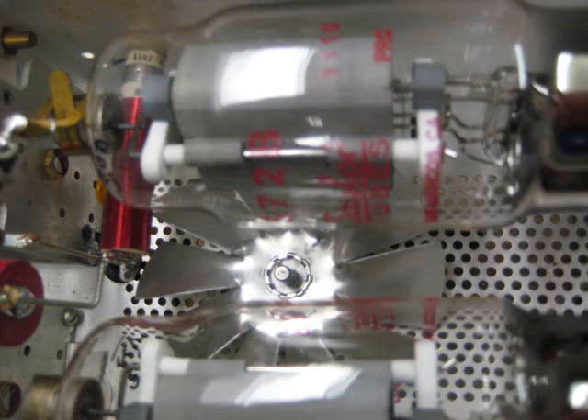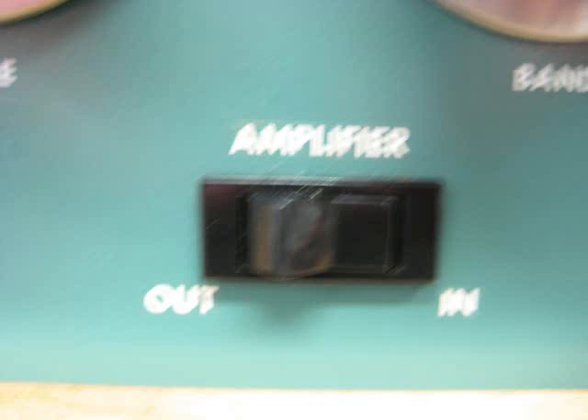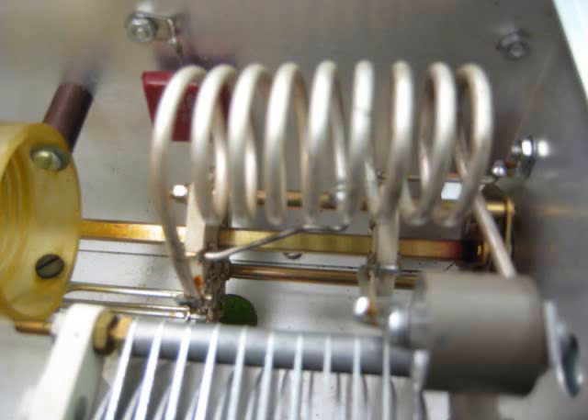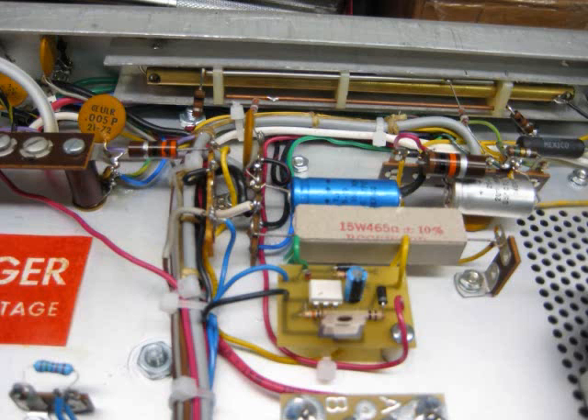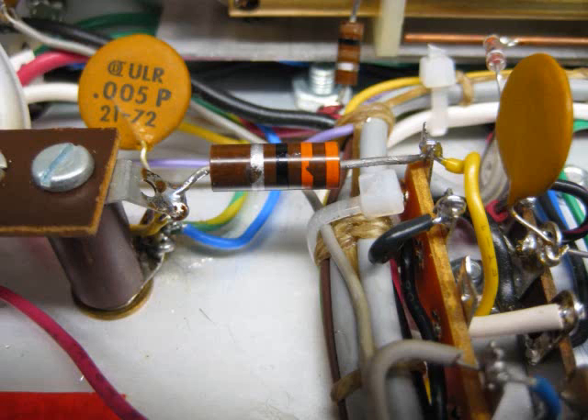Total lapse time was about four days to do all this work. And I was rewarded by the fact that when I did turn the amplifier on, I was able to make it work. Here's a picture of the front panel — someone went through a lot of work to add this amplifier bypass switch and did a really nice job, so that kind of caught my eye. That is non-standard; not just a toggle switch, but someone worked really hard at that. There's very little tarnish on the tank circuit components, so I felt pretty good. Here's a shot of the completed wiring close-up — that 33 ohm resistor is part of the antenna relay circuit.